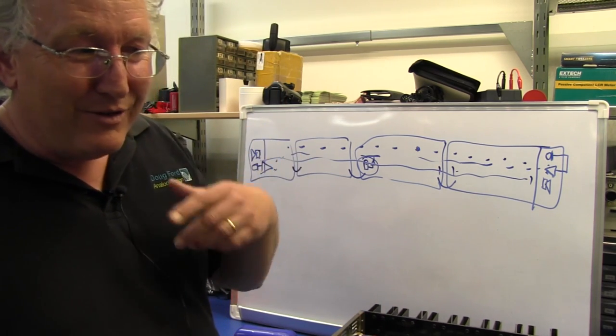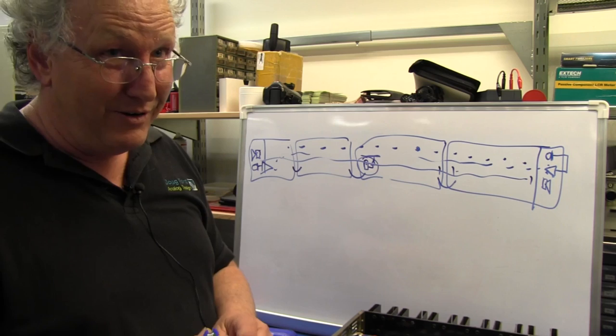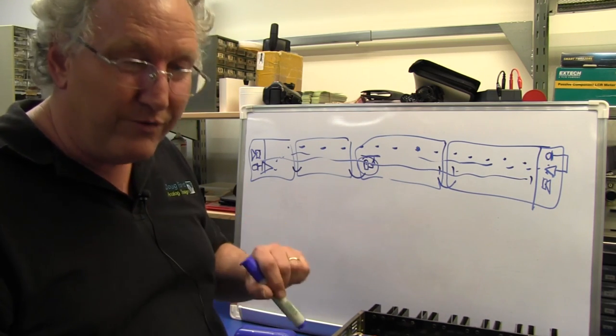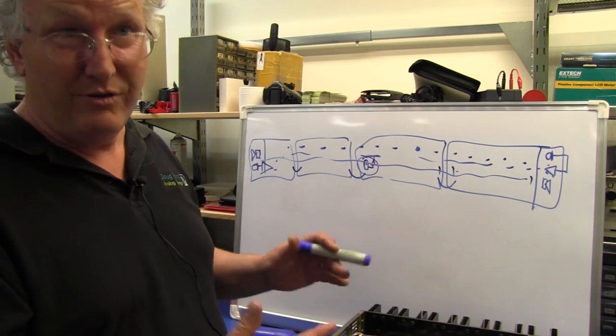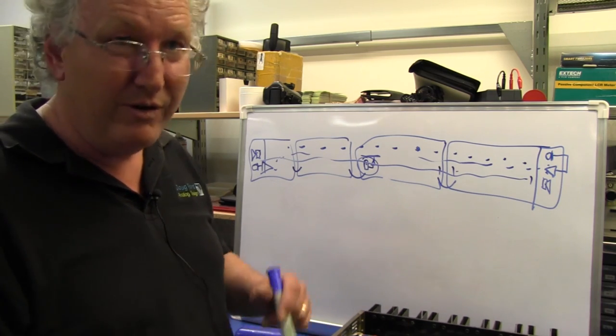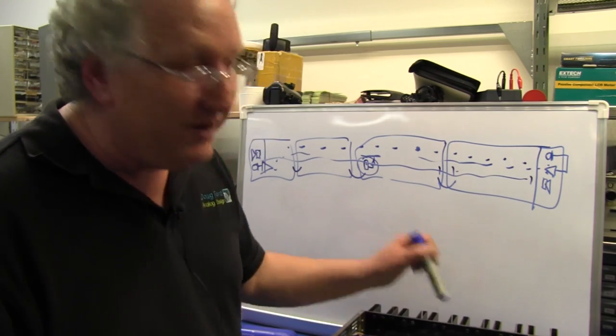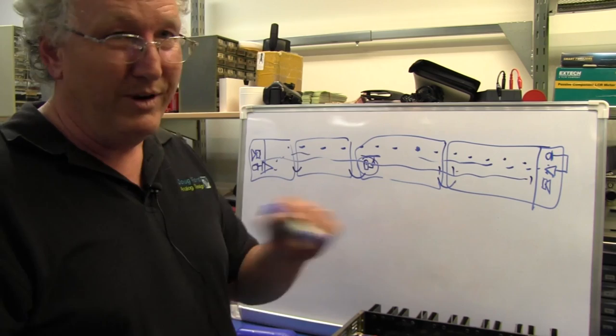It was after that first batch of amplifiers went into production that we were made aware of this, so we started on those first ones, fitting extra coupling capacitors on the output of the transformers so that DC wouldn't affect the transformers. Later versions, such as this one, had coupling capacitors incorporated on the PCB.